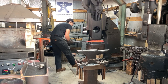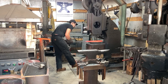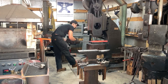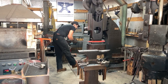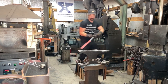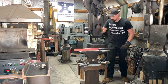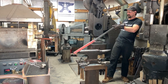again several times. It'll come off the rollers even thickness but not necessarily flat, so then I take it over to the hammer. I'm not forging it hard at all, so it's not changing the dimension, but it's straightening it between those big flat dies just to get it real close. And then it won't even come off the hammer perfectly flat. So then I just take it over to the anvil and really just take whatever tiny remaining curvature there may be out by hand with a 4 pound hammer